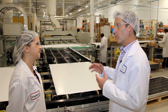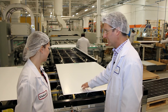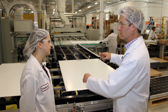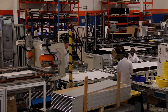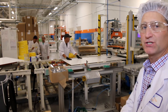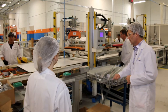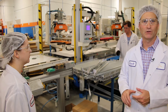After the module is laid up, we run it through a laminator which bakes all the material together. At this stage we have a completed laminate with everything baked together. You'll notice the material bleeds over the edge — this ensures the material is sealed in all four corners so that even if it wasn't laid perfectly, we can trim the edge for a perfect seal. We then add a two-sided glue tape around all edges before taking it to the framing machine, which uses a robot to compress the frame under compression for the life of the module.